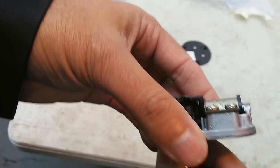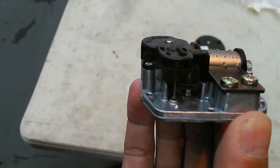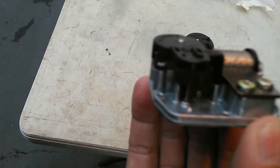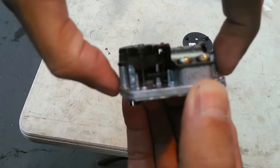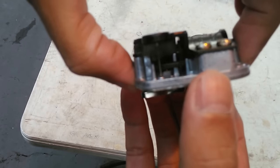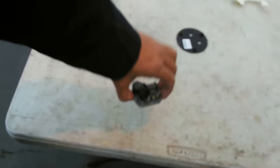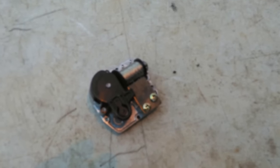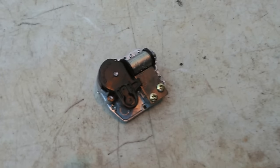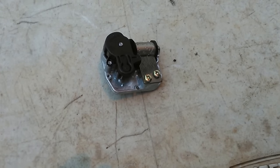When I had it in the vise, the combs actually got moved, so I unscrewed them and moved the combs so they're properly clearanced — there's got to be a little clearance between the end of the comb and the actual cylinder so it doesn't jam. I got the works back in there by wedging it and dropping the little gears in the back. Now for the final result: if you have the mechanism just sitting in the air you won't get much sound, but when it's in the sound chamber at the bottom of the snow globe it's amplified. Thanks for watching — I'm going to put it back in the chamber and seal everything up.